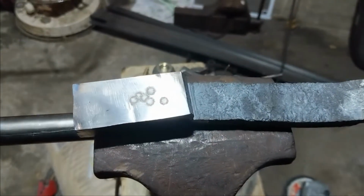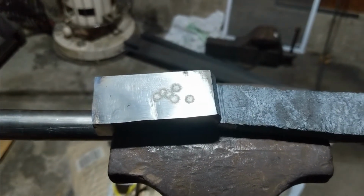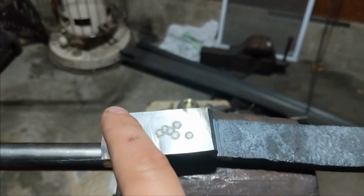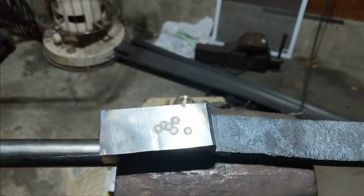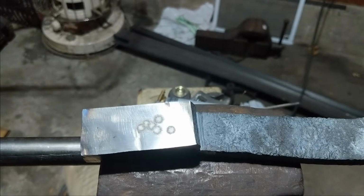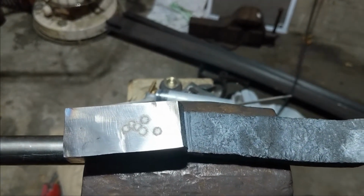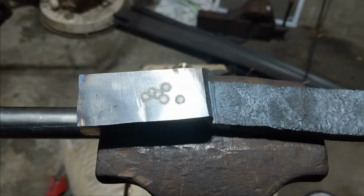That is because of the sodium, the atomic emission spectrum of sodium, which is dominantly, to the human eye, a yellowish color. The same principle applies here, where the different elements that make up this metal, i.e. iron, carbon, cobalt, nickel, manganese, and so on and so forth, all give off a unique spectrum of light. By inducing a spark against the surface and measuring the wavelengths of light that come off and the relative intensities of those wavelengths, you can develop a quantitative and qualitative assessment of the elemental composition of that steel.